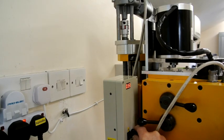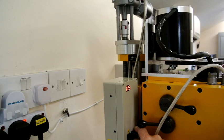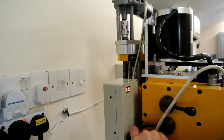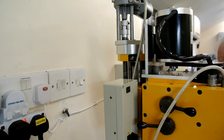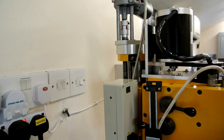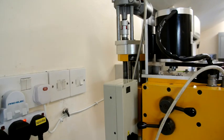So I turn this on and you can see it's just barely turning over, so you can do it in a very controlled way. This is a 2mm pitch screw on the Z-axis. What I intend to do — which I haven't done yet — is fit a readout somewhere so that I can read off accurately what the head is doing when it's raised or lowered. That means I won't need to use any of the manual control over this quill at all, which is the same as I've got on my CNC mill.